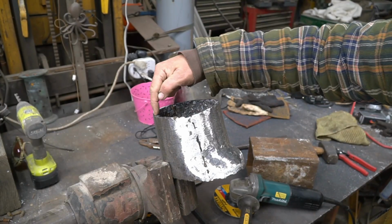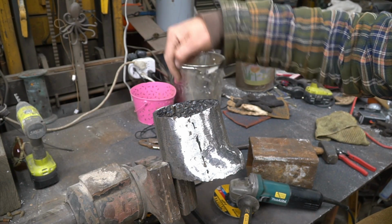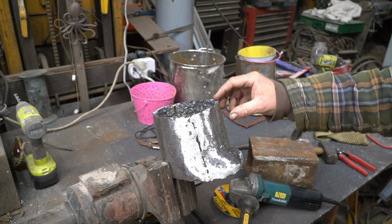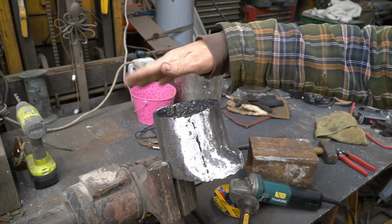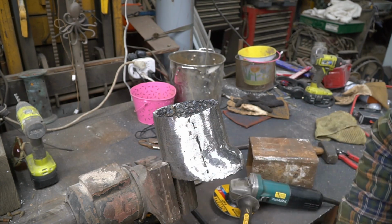This is gonna come through. You can see I got pretty good crisp edges around here. But starting in here, it drops down, which I didn't get these cut off properly. So I think this all needs to build up just a little bit by eye. Looks pretty good till it gets right into here to here. So I'm gonna just layer the welds on, grind them back off. A few little dimples you can see need filled in.